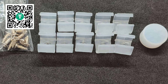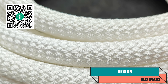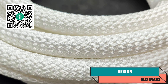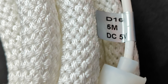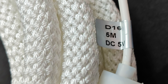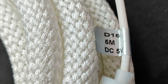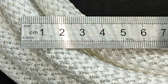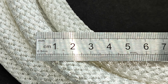Externally, the strip looks more like a nylon rope than a lighting device. However, unlike a rope, it glows and is not designed for heavy loads. A sticker with the specifications indicates a diameter of 16 millimeters, a length of 5 meters, and a voltage of 5 volts. The connector used here is quite standard — a 3-pin one — so the strip can be used, for example, with WLED controllers based on the ESP32. The LED strip is housed in a flexible silicone tube, which makes it waterproof, and over that, it has a nylon braid.